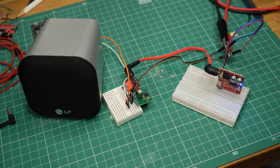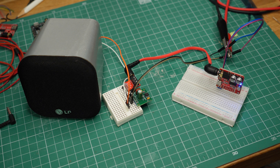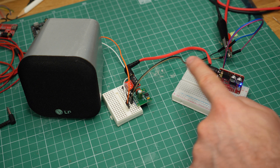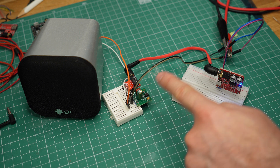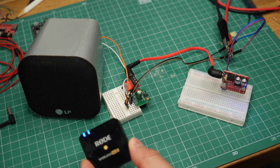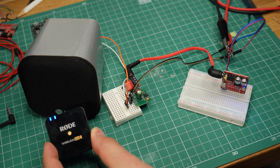Here's what that looks like in practice. This is the receiver and this is the amplifier I built in my previous video. For this demonstration I am intentionally using longer cables because that increases the amount of noise we'll get. That sounds terrible. Inside a device like a Bluetooth speaker, where you also have an individual amplifier and a Bluetooth receiver, these negative effects of a ground loop can be largely eliminated by optimizing the placement of every component.